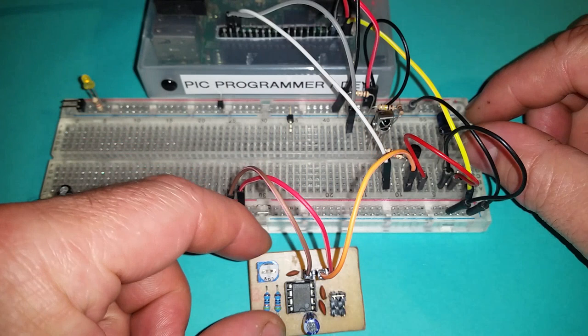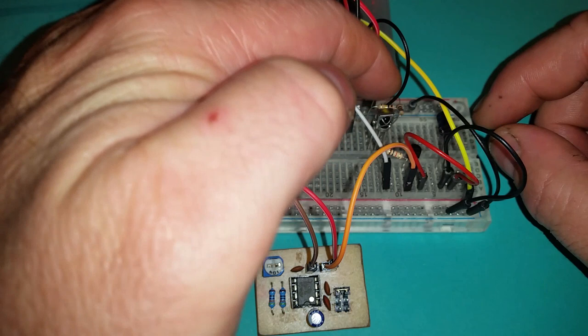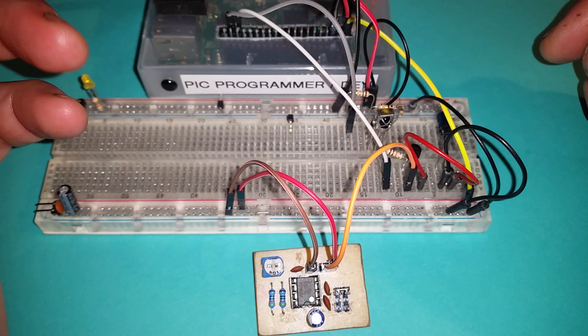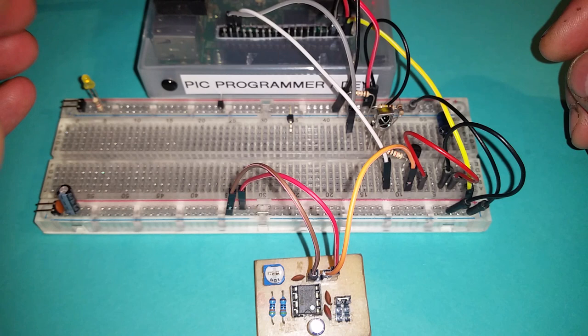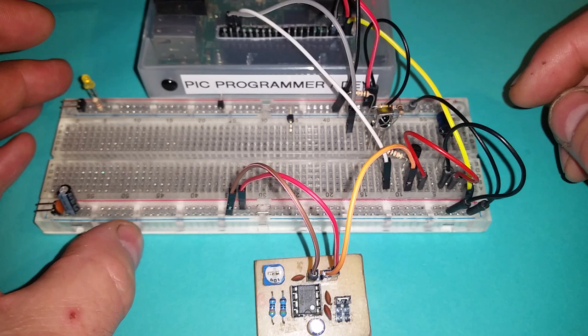I'm still using the same receiver as in the last video and I've got a 555 timer to drive the 38 kilohertz that this LED needs in order for the receiver to receive information. But I won't be transmitting from this LED to this receiver — I'll be transmitting to a television, set-top box, hi-fi, or anything with a standard remote control. I'll use the receiver to record key presses such as volume up, volume down, and power on and off, then play those codes back through the LED from the Raspberry Pi.